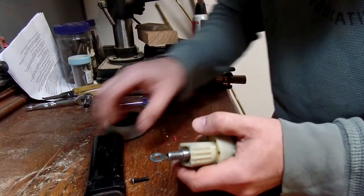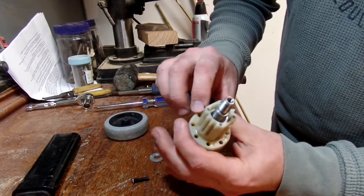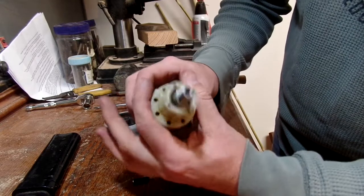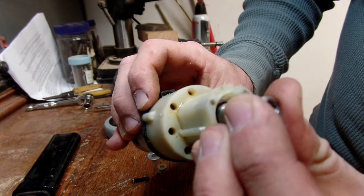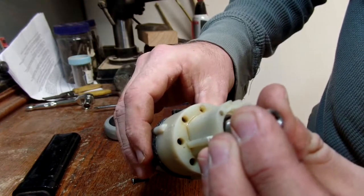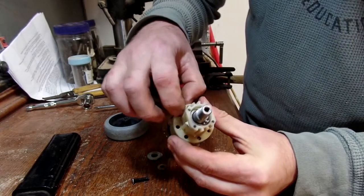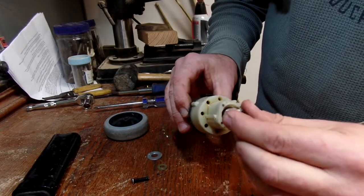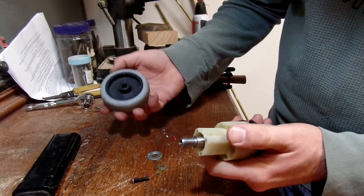Now I'm going to show you a little bit about wheel mounting and also a problem. These little holes where the bearings fell out — there's one that didn't completely come out. If you spin this, every so often you're going to see a little high point come through, and then there are these valleys. If you don't drive something down in there — a grub screw or something, probably three or four of them — it's going to give you a problem. You're not going to have much torque.